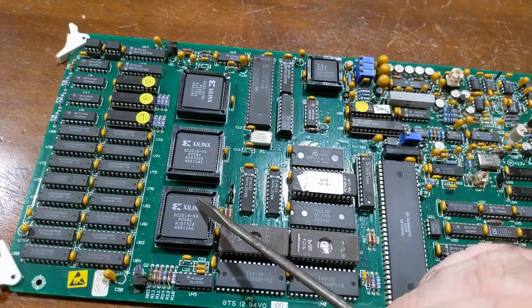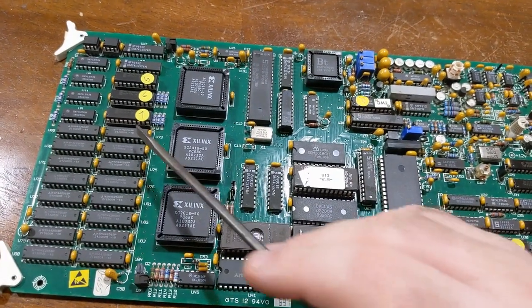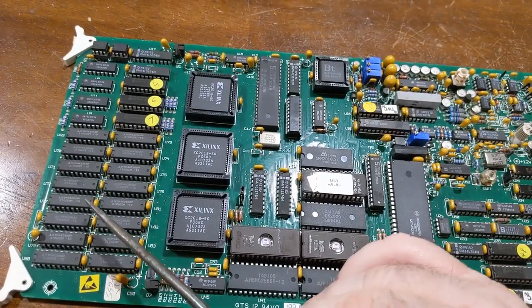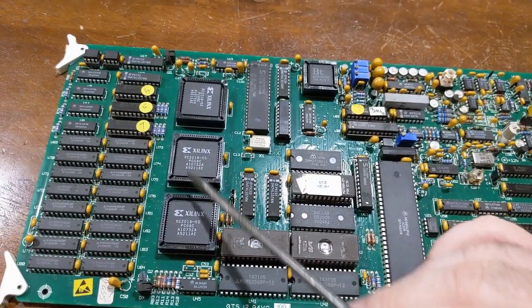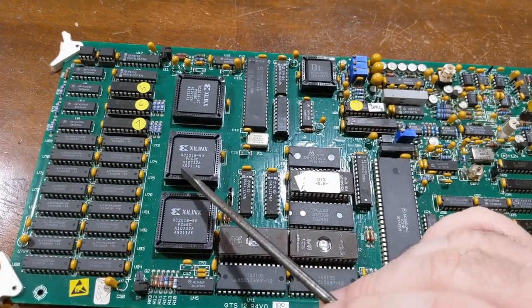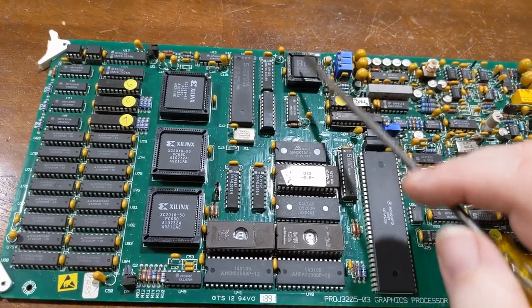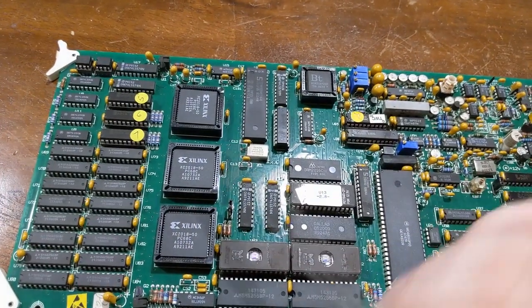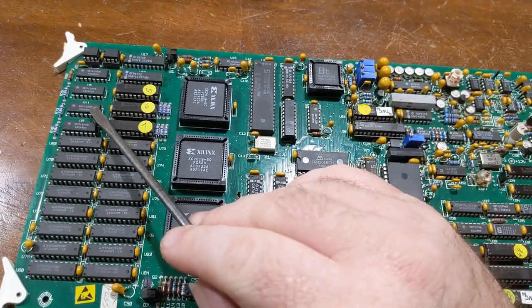These are the muxes. These are responsible for switching and selecting what's in this video memory, which there's 2 megabytes of, by the way. This is responsible for switching the data out of this memory to this RAMDAC, for each period of the pixel clock. And there's 8 pixels at a time. It's handled for one tick of this counter.